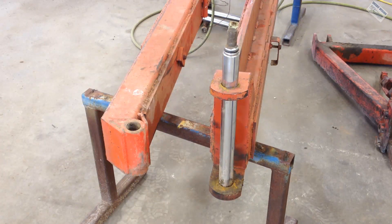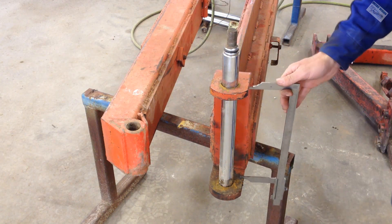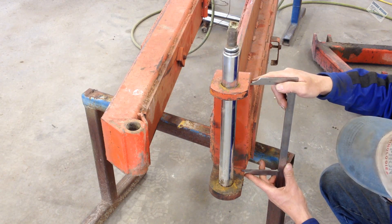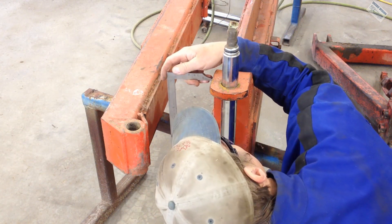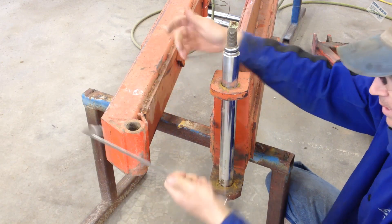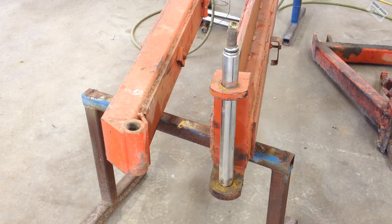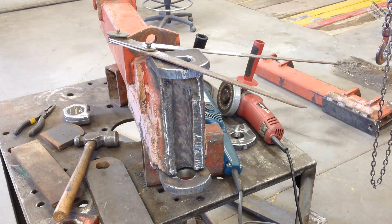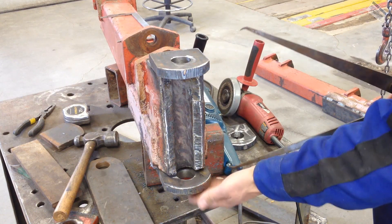The way I did this last time, I used my vernier calipers. I've got a little more gap on this side — I think that ear is bent. I might actually have a little more gap on this side than the other. Nope, it hits there. Okay, same measurement then as the other side. I'll use my vernier calipers to measure in there and transfer this over to the spring calipers to make sure we're close. Yep, that's still set the same. And then we'll make sure nothing's hot.